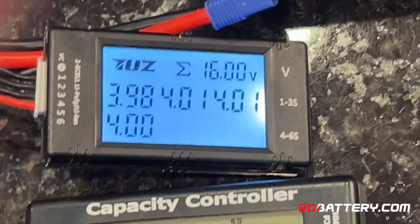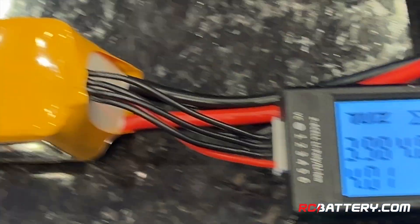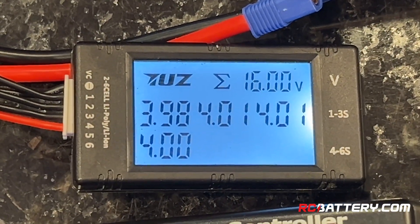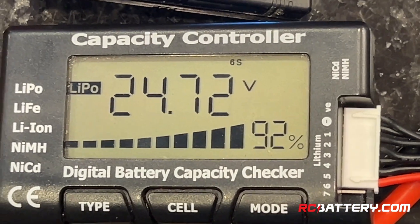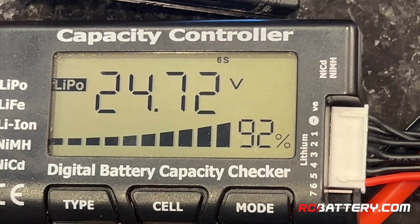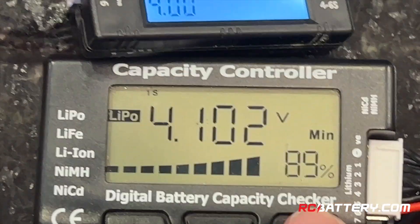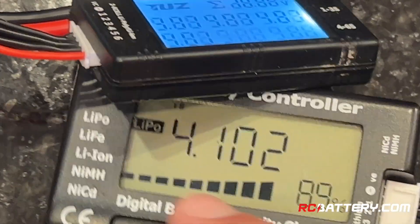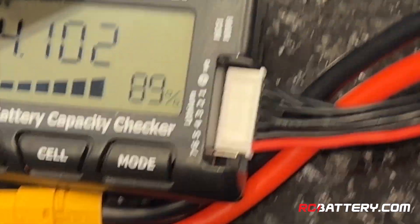Here is another very useful gadget I would never be without — I have a whole bunch of them. These are cell voltage checkers. I'm connected to the balance port and you can see exactly how close to being perfectly balanced this particular pack is. There's a more expensive one that lets you choose different chemistries. This one actually displays how much capacity the battery has left. You can scroll through the modes to see individual cell counts — cell 2, cell 3, cell 4, cell 5 — and it will tell you the voltage of each particular cell. Just plug in the balance port — very helpful.